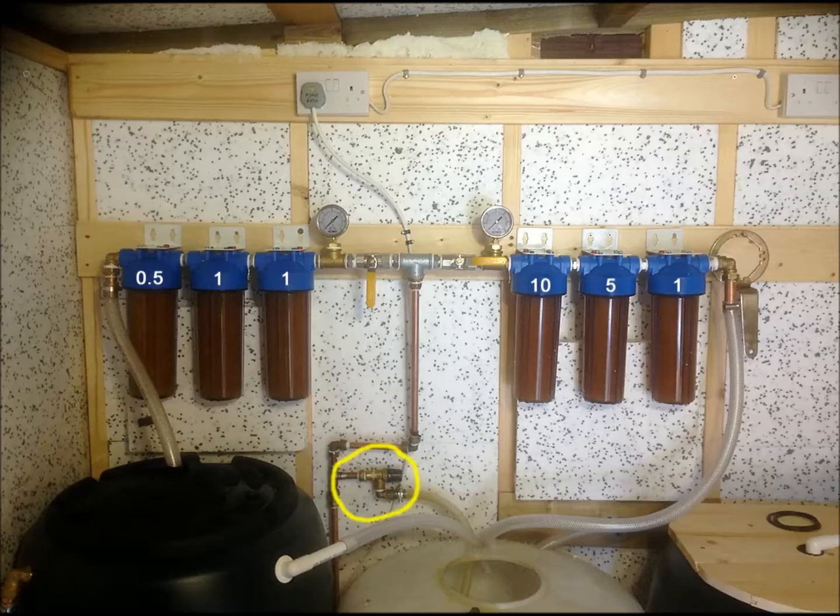You might also notice this strange-looking thing down here — it is actually a pressure relief valve. You've got to be careful of your pump; you don't want to kill your pump, that's expensive equipment. This one I believe is set to 7 bar. So if pressure builds up in this system — let's say I was stupid and left both these taps closed — then it's going to pump along here and the pump has got nowhere to push the oil, and all that pressure is going to build up in the pump and ruin it. But once it reaches 7 bar, this pressure relief valve opens up and allows the oil to flow back into that barrel. If you see anybody use a centrifuge, you should see them use a pressure release valve for that same reason.